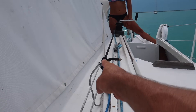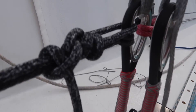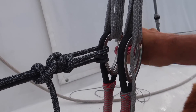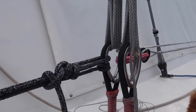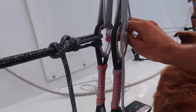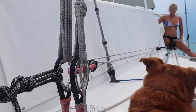We have a piece of regular line that Sierra is going to winch tight, and that's going to pull our tail nice and tight. On top of that, we also have a counter line going all the way to our front cross beam, which prevents the dead eye from being pulled forward as we tension. Without that counter line, we'd be bending the whole dead eye forward — this keeps it nice and straight up and down.